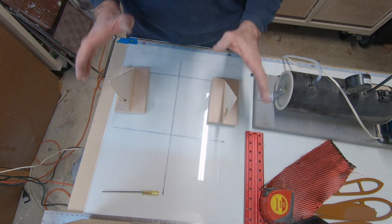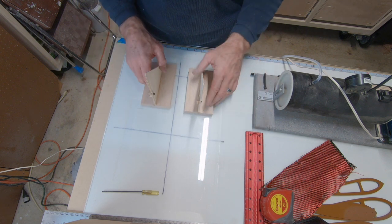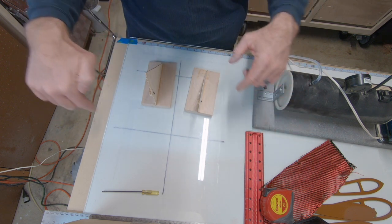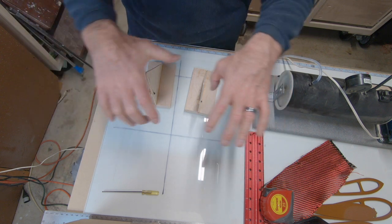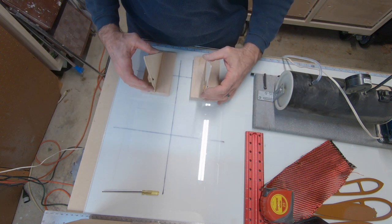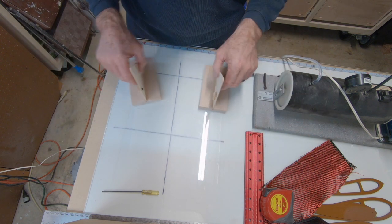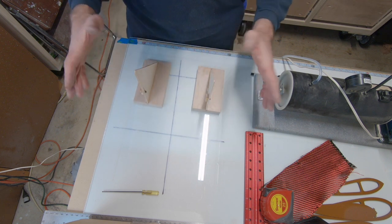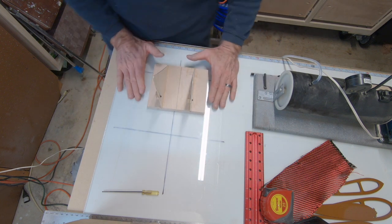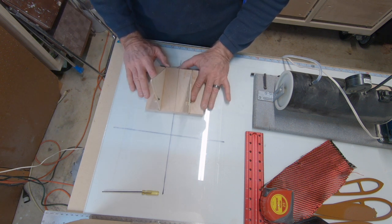And the other thing you can do, if you're joining your stab halves and you have no way of making sure that center line is followed, and you're going to adjust the incidence between each stab half, you can plug these things in here and go around the perimeter, and it'll allow you to glue it together correctly. So I think that's a quick overview.